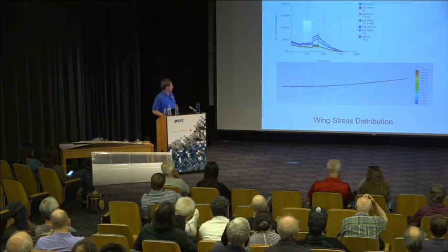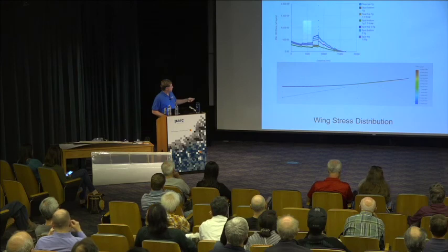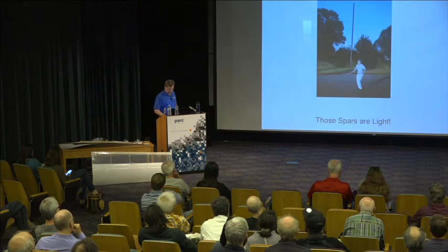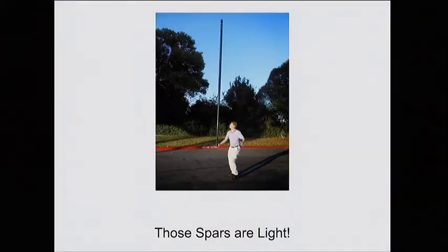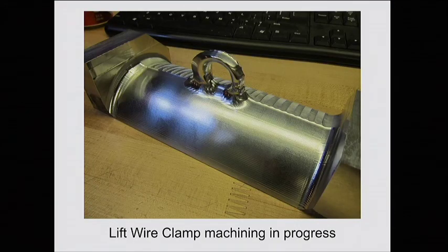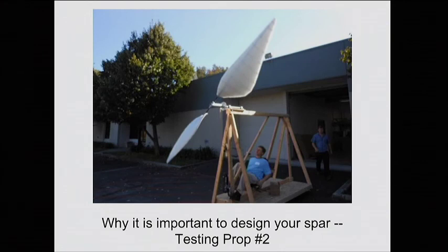This is finite element analysis results. Every notch here is where the spar cap is changing, and this is where the lift wire is taking up most of the load. This gives you an idea of how light it is — this is one 6.7-meter wing spar that I'm balancing on one finger. The entire airplane weighs about 100 pounds, about half the weight of the pilot. This is the lift wire clamp — one of the few aluminum parts — that gets glued and lashed to the wing. This part is partly machined on a four-axis mill.